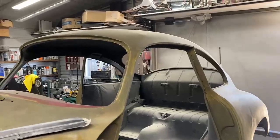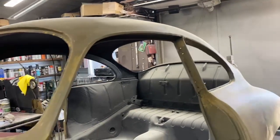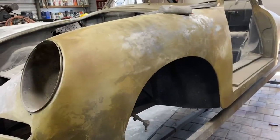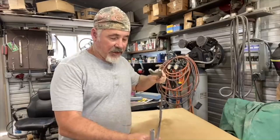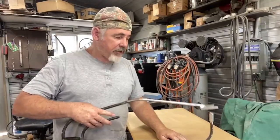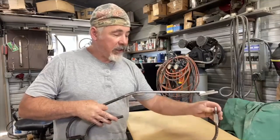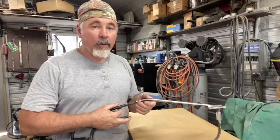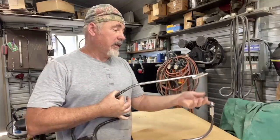I made this tool just to help me out on the roof. There's a few dings on top; I still have to dolly it out but the roof is pretty much near perfect. The tool I'm making is a common tool but I enhanced it. It's a bullseye pick — different body people and manufacturers sell this stuff. They have only one tip and it's just a pointer. What it does is basically bump the dent up, and it's great for where you can't really get under the fender and you're having trouble locating where the dent is. You just put it where it needs to go and this will pull the dent out.